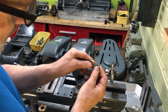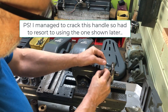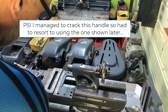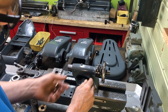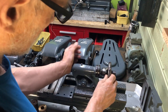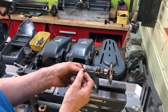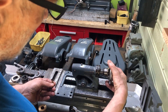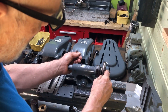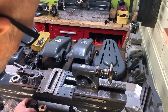My whole initial problem was knowing that this design has the screw integral with the barrel and the nut integral with the handle. There was also a bronze bearing at the rear, on the left side of the slot, which is fixated with a half washer. The problem was that the slot had become worn — the bronze bearing had worn out and become sloppy, with too much end play.